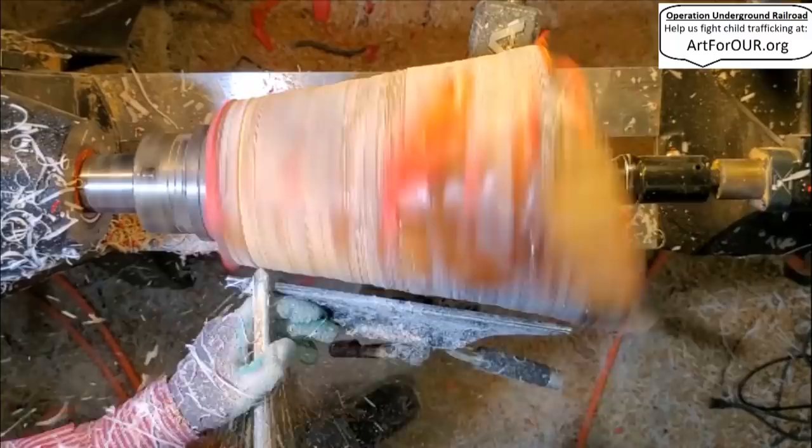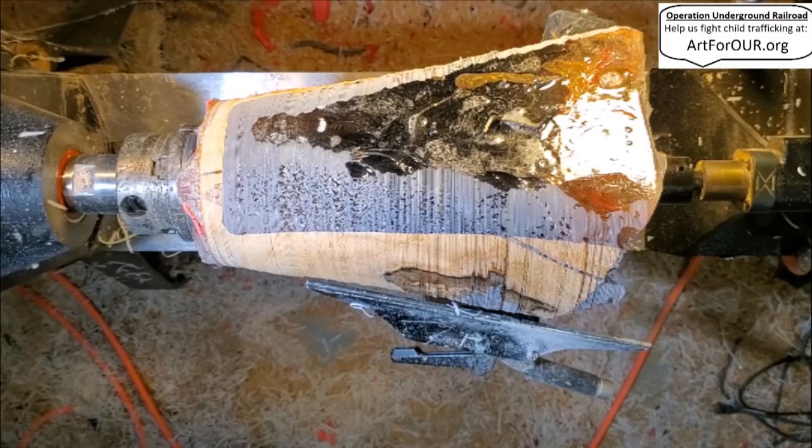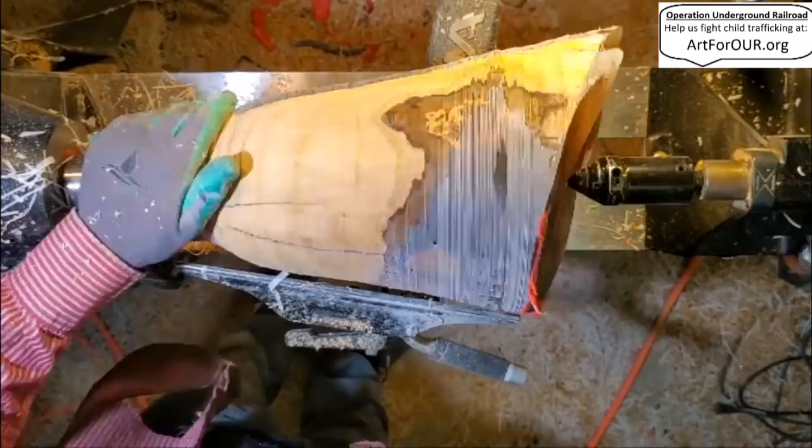If I can do a pressure pot, the Total Boat Fathom resin takes several days to set up. Most bubbles come to the surface. It saturates your wood without any issues. And in a pressure pot, that stuff is almost crystal clear. So I'm really happy with that. But when I'm doing this delayed resin manipulation, I have to be able to get to it. And often the projects are just too big to fit in a pot.